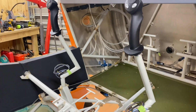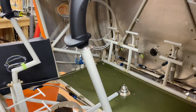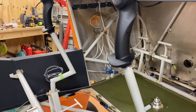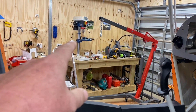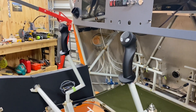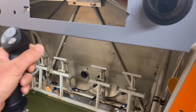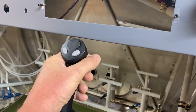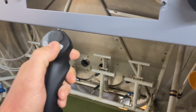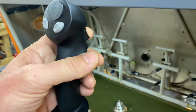For the last couple of days I got the control stick grips mounted into place. The main issue was these little bushings that sit in the top of the tube — I must have ordered one size too large, and I didn't have a lathe to turn them down. So I put them in the drill press, shoved the bolt through the middle, put some tape on, and held them in. It took about an hour to turn them down with a file, but I got them to the right size and they bolted in quite nicely. There's a push-to-talk on the front and another button down at the bottom.